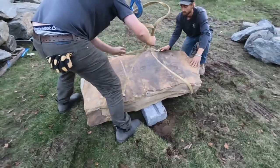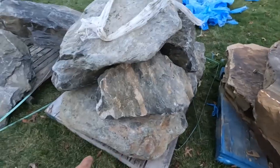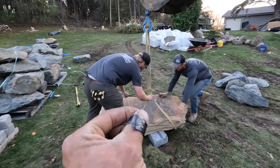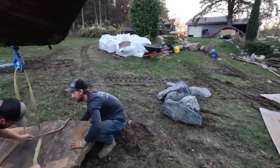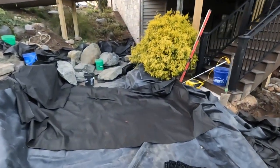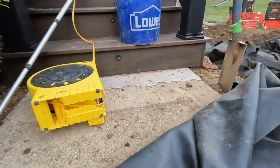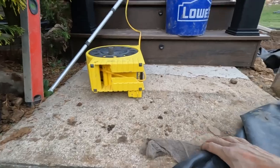One of the bridge pieces is Black Hills rustic sandstone. It will match up very nicely with a lot of the grays and rust colors that are part of the aqua blues through here — it just matches up really nice and it's hard to find. What the guys are trying to do now is find the exact center of weight on the stone so that when we lift it, the stone is nice and plumb level left to right as well as front to back. That way when we set it in, the corners aren't diving down, making it easy to shim when it's sitting level on the strap. We've got some aqua block panels to vault up the bottom to help build up our elevation. When we set that first stepping stone as part of our bridge element, we want the top to meet up at the same height as this stoop that comes down from the staircase. Due diligence on elevations is key.